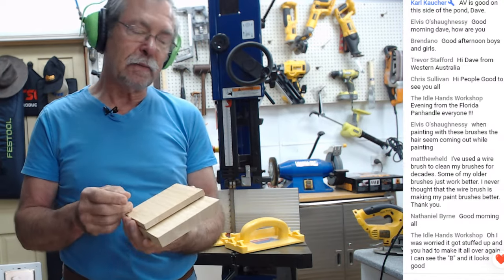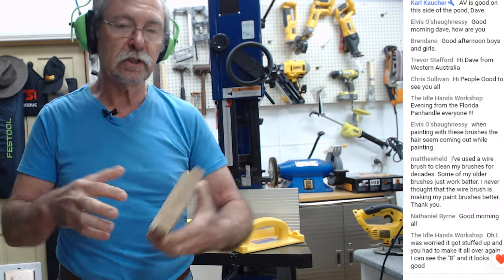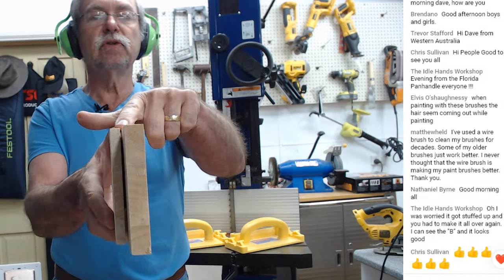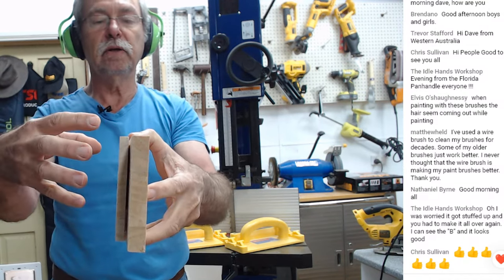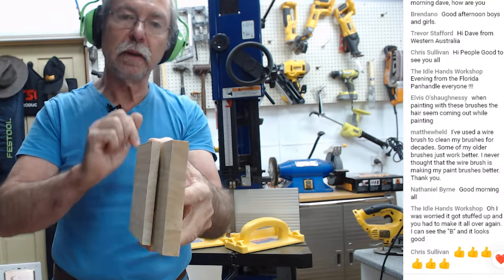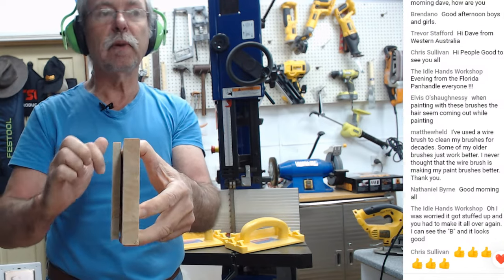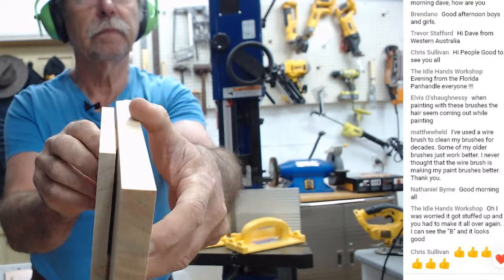And I think I should possibly just do a dedicated video on how to do that rather than just incorporate it in a live stream. So I have this space there that's just over 2 millimeters deep, which is the male section sitting proud of the blank, but the penetration is 4 millimeters in there, and that will work well. So I've left that space so there's enough room for my bandsaw blade to travel in there. You're nice and close, you can see it.